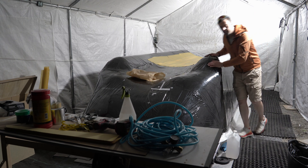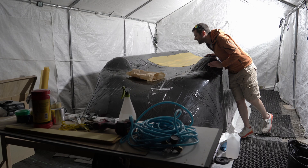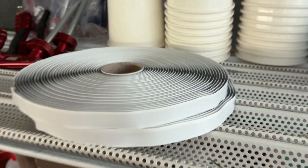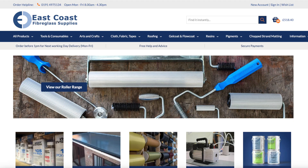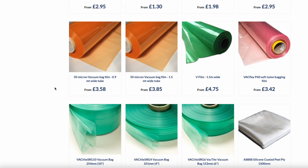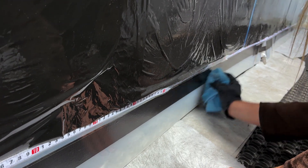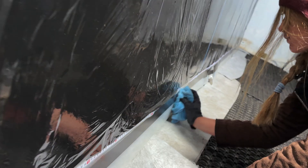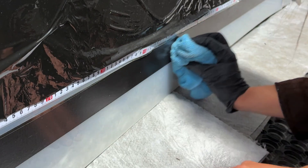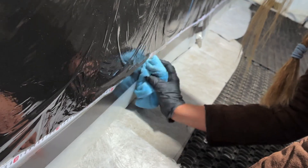So what we need is a patron of the channel to pay for a large warehouse and workshop for us. This is a pretty good moment to thank one of the two key suppliers for this big layup job. Most gear, save for the resin, like this bagging gum seal tape, was supplied along with sourcing tough-to-find fabrics by the team at East Coast Fiberglass Supplies, link in the description. And that gum tape will need to run continually around the lower edge of the part. It will run along one long piece of Gorilla tape, the top film of which provides an excellent surface to seal down upon, and it's easy to wipe clean with alcohol on a clean cloth.